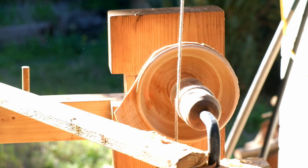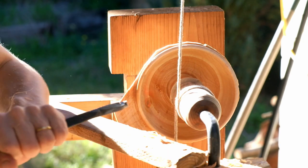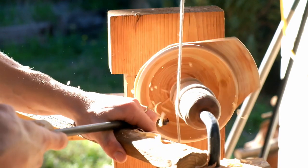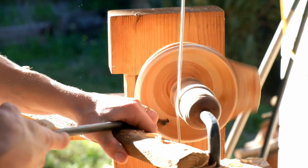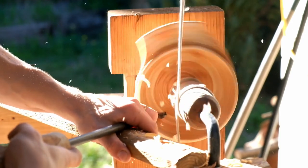You can see I've made a big step there where that's not usually how I turn that area and I'm going to see if I can clean it up. It looks thinner than it is because this is jacaranda — it's a light wood, it goes translucent when it still has quite a bit of thickness left in it. And here you can see just how irritating that little catch and dig on the return stroke can be.